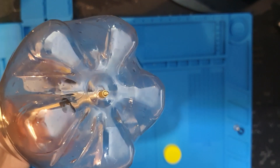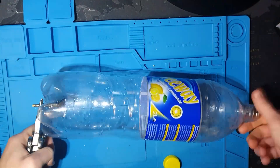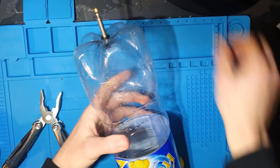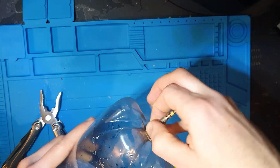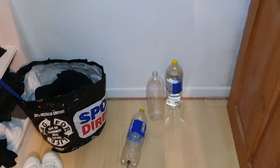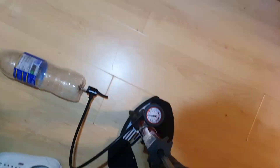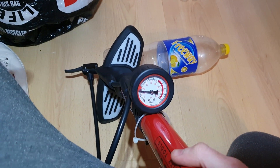The hole's not big enough, so I re-drill it. I then place another o-ring on the valve and screw the nut on. Now we've just got to test whether it can hold any pressure — I'm going to test it next to the dead corpse of the previous air tank. It's pressurized to about 30 psi. No leaks, so looking good.